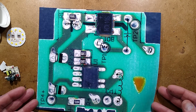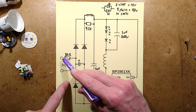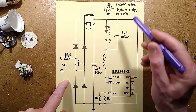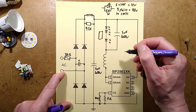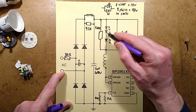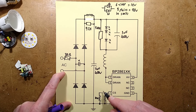Let me bring in the datasheet, because the datasheet is all we need. I've added the 30-ohm fusible resistor where they've shown a fuse. There's the little capacitor position that is not used. They've added a 9.1K resistor and an inductor. The only other thing to add is a 510K resistor across the LEDs — almost certainly just to avoid ghosting. There's the parallel-series array of LEDs; I'm guesstimating 90 volts across them. Interestingly they used the same value capacitor for both rails — quite a low value, but it works. And there are the two sense resistors at the bottom.